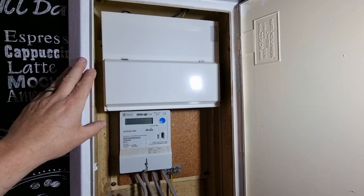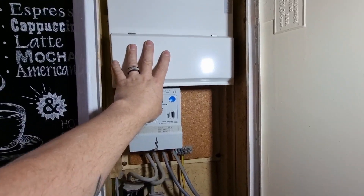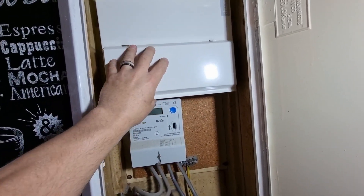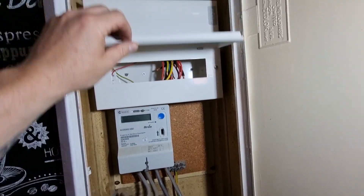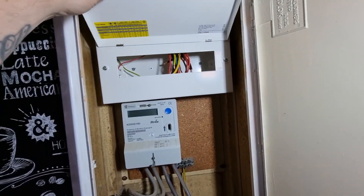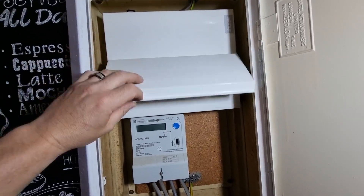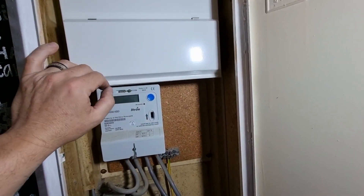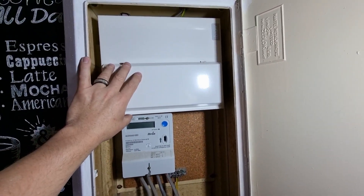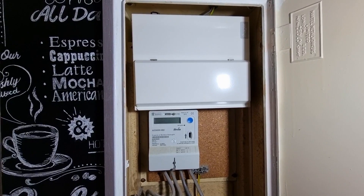I thought I'd show you why we've done this part. We were very limited on space in here, so everything I've been doing has been about not only getting the board in here but making sure the flap actually opens. I got to the stage of fixing the box to the wall and I thought, before I put all the breakers in, I should make sure you can actually open the door — because the worst thing would be if I'd finished the board and the door got caught. So I thought I'd better fit this now rather than waiting till the end of the job. I hope that's helped someone out.